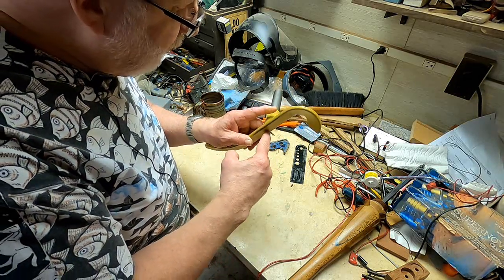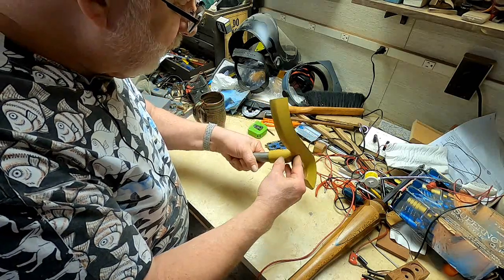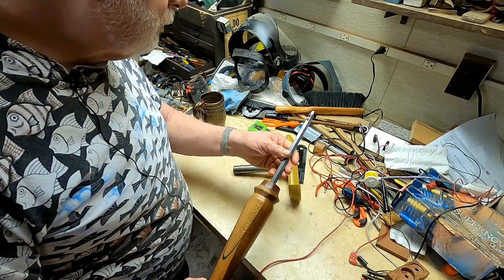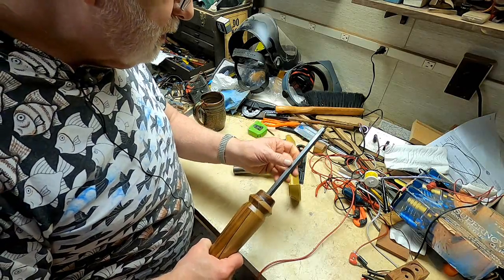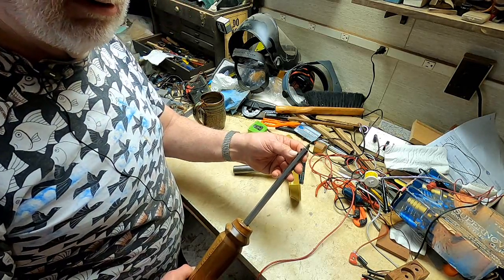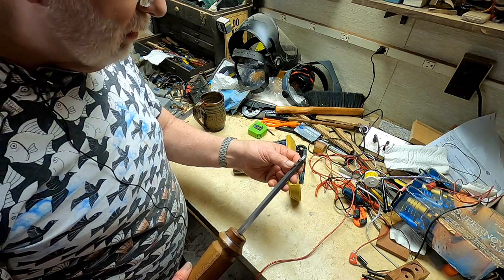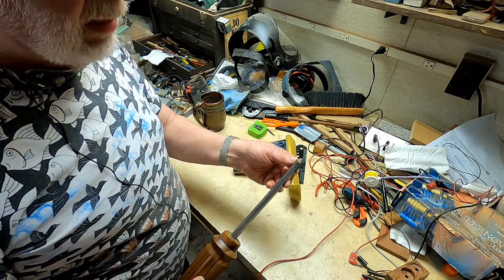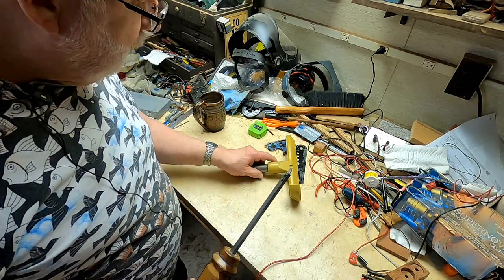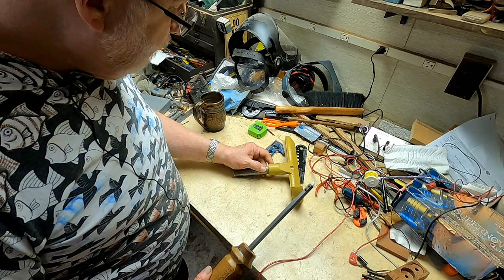That will support this end. I'll grab it in the chuck and spin it on my woodturning lathe. As for how to cut it — the woodturning tools I make have a body and a bit. This bit is M2 five-percent cobalt tool steel, ground just like I would for a metal lathe. So this will cut metal. I know that because I've already turned brass, copper, and aluminum on my wood lathe with this tool.